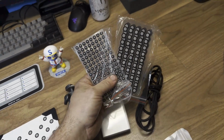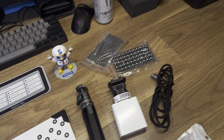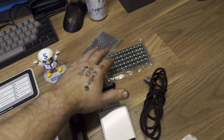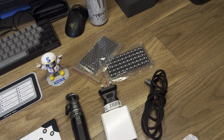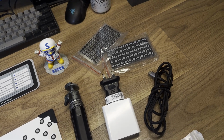Now, tracking dots are handy for these kind of scanners because if you have big flat panels, which obviously the fast mode in this can scan, like car parts, bumpers, that kind of thing, they're lacking in geometry, and a scanner needs geometry to figure out where in space it is. These tracking dots are reflective, and the infrared light bounces back off to these, and the scanner can map these out in 3D space, so it knows even if there's no detail on the part, the scanning dots will let it know where it is, and it will still map it out properly.